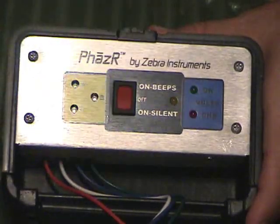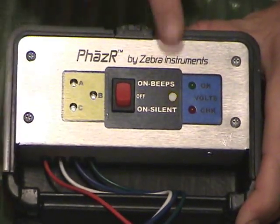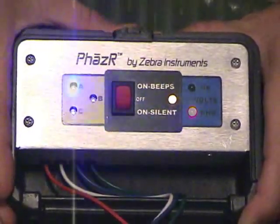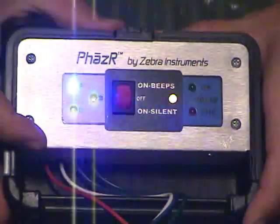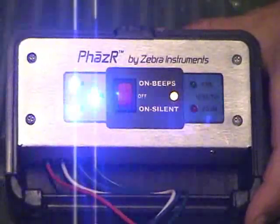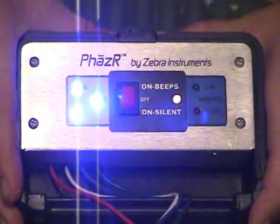This is just the demo dance — this thing will sit here and do this a little bit and then it will start to go through all the phases again. So we're going to run it through where it's making noise now. Battery indicator, L1, L2, proper rotation, proper voltage, improper rotation, proper voltage, voltage imbalance, ghost phase. You'll notice the last two are totally silent — it's kind of like your wife in that respect: when it goes silent, something bad is about to happen. When it stops beeping and making noise, that tells you there's an error somewhere — either you have a voltage imbalance or you get the ghost phase — so you need to check something out. And it's pretty loud. The camera's about three and a half feet away so you should be able to hear it in the mechanical room fairly easy.